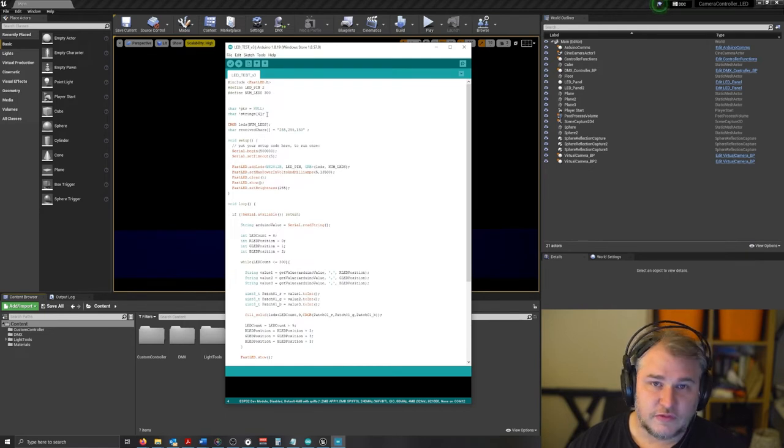This becomes useful for some code later, which is essentially going to split up a string into different sections and assign them to variables, right? Let's keep going through this really quickly. We've got the CRGB number of LEDs, which sets up the FastLED library. This is just a bit of a test that can be deleted, but we start the serial at 500,000 baud rate, with a bit of a timeout just to make sure that we've got enough.